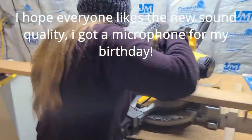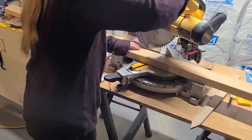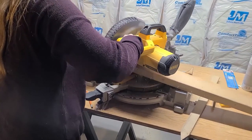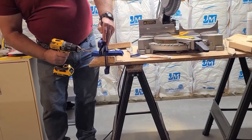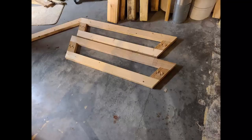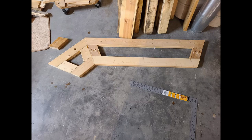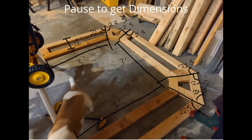For the bar we wanted to create a U-type shape by connecting three separate segments and cutting them all at 22.5 degrees. We got some two-by-fours from family and cut them at that 22.5 degree angle, then screwed and glued them together. The reason we're making this in three separate segments is because we're moving to a different house and it's going to be turning some tight corners.